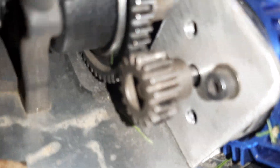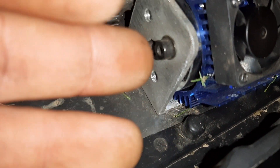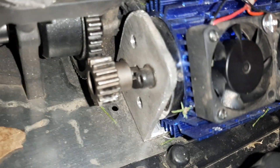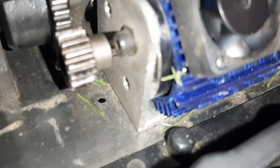That's the motor mount right there. Basically what I did was I drilled two 5mm holes, because this motor requires 4mm bolts, and I wanted a little bit of movement in there — washers, long enough bolts to go through the plate, which is just a piece of aluminum tubing I turned into an angle bracket. If you could find a piece of aluminum angle bracket, it would work just fine.